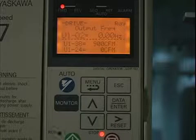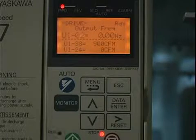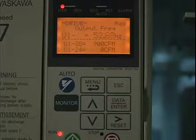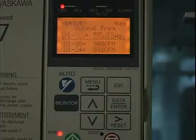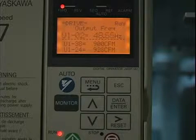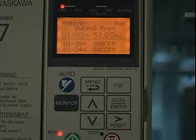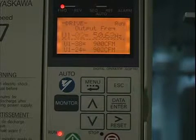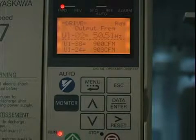What we should see is that it should start to regulate. It'll take a couple of seconds to start accelerating up to speed. We'll watch our feedback go up there — it should after a little bit stabilize. At that point I'll change the damper position so that we actually get better airflow and are forced to run at a slower speed, which will put us into sleep.